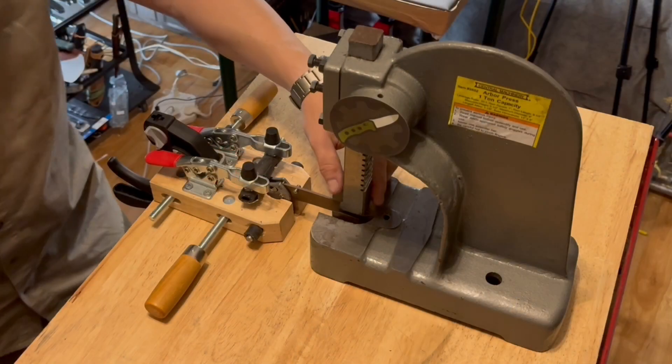I intend to strike the blade three times and afterward show all three strikes in slow motion. Checking the lock for function — the blade sits a little proud of the striking frame. With my trigger finger, I move the ram head upwards into the well of the arbor press by the same distance, to make sure that no matter what shape of knife I'm testing, the ram falls with the same velocity. The forces in the moment work out to be similar to what a 50th-percentile male can exert striking with a backhand strike at a distance of 6 inches, which is a realistic scenario.